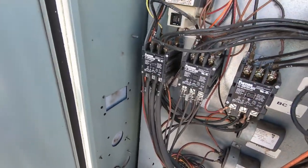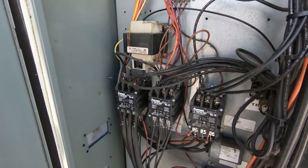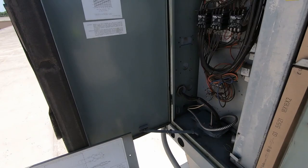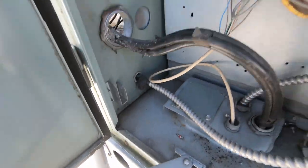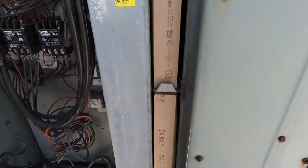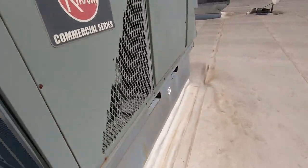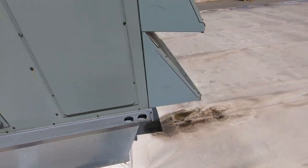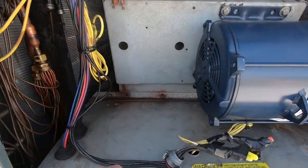We're going to see if we can get to the bottom of what blew our 100-amp fuse. I'm going to go ahead and get some panels uncovered, do a little electrical search, and then we will install a phase monitor - probably right here. 100-amp fuses don't normally just blow on their own. That coil is awfully dirty, so we will give this thing a thorough look.